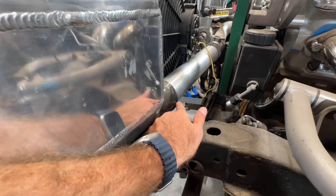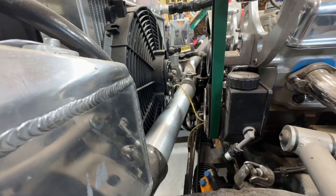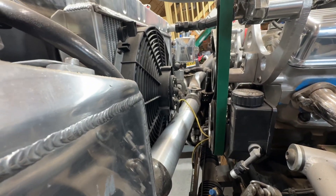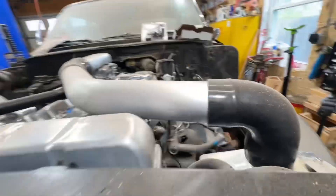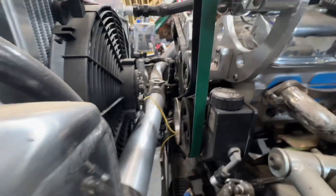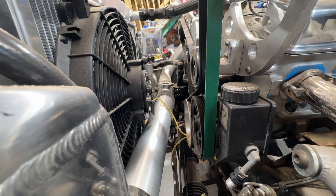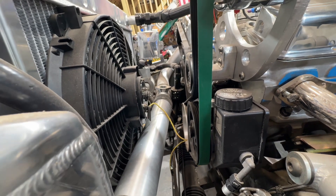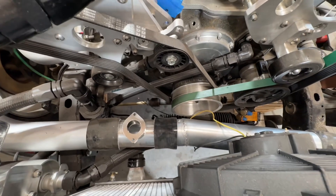This isn't perfect, but I think I could straighten it out a little bit. Maybe there's some adjustments I could do. I didn't want to have too many couplings — there's a coupling here, two around the blow-off valve, and then there's a boot on the supercharger, a boot here and a boot there. These two are unavoidable. I could weld the blow-off valve and the pipe all together and make that one continuous piece. You can see it comes off the supercharger, down through the blow-off valve, and there's my weld-up pipe.